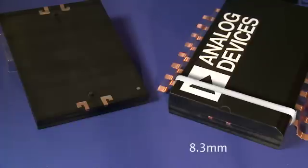In this case, the tie bars are no longer on the creepage path. These new packages fit on the same PCB footprint as the current devices, as long as there's room at the ends of the layout. The new package is designated as SOIC-IC in the datasheet, for increased creepage. And it's available for all of our reinforced devices with a 1-minute isolation rating of 5kV RMS.